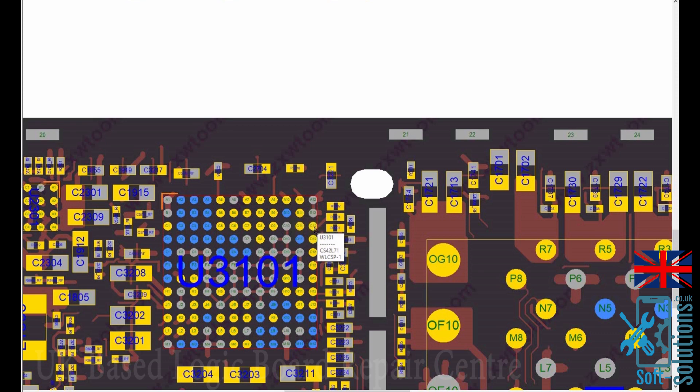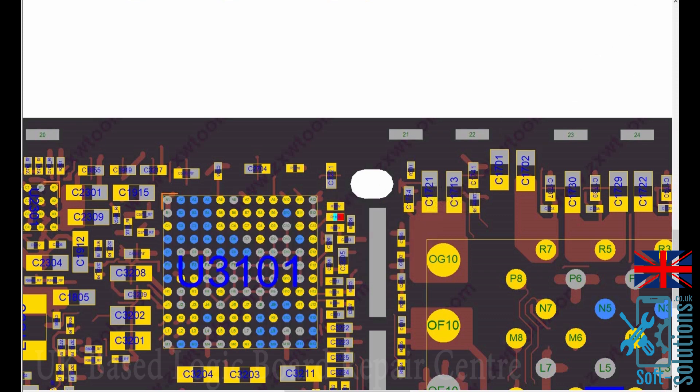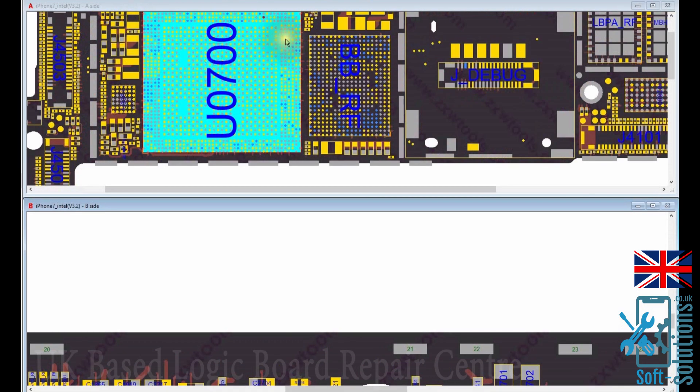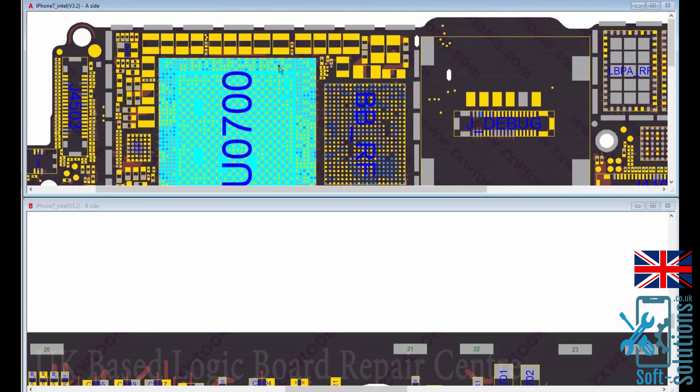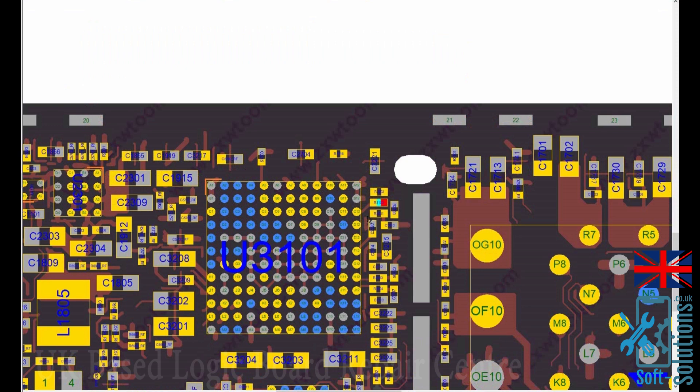The more commonly disconnected trace from CPU to codec is C12. C12 goes from the audio IC through a resistor, and the other side is connected to the CPU. When this disconnects, the audio IC has no connection to the CPU — it's the same as when a human nerve gets disconnected from the brain: that area just gets paralyzed.